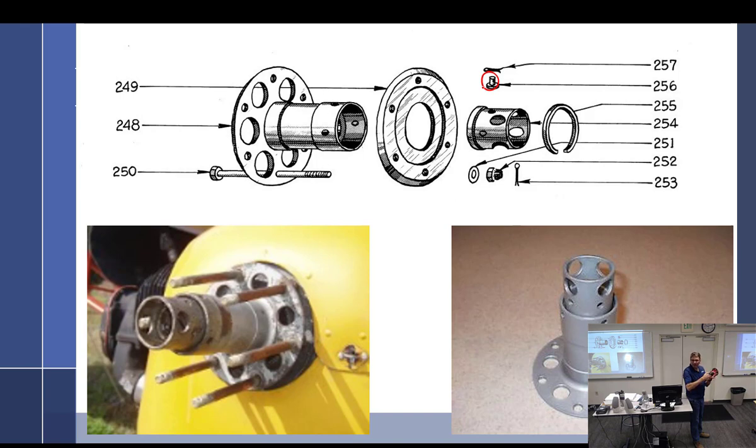All right. When you go to take it off, you loosen this up, and then it's going to get real loose. And you keep going, it's going to suddenly get really tight. What it is, there's a ring in there. See the ring right here? Mm-hmm. There's a ring. It's going to hit that ring. Now as you turn this, it's pulling this off of the taper shaft. So it's a puller and installer all in one. This you can turn to put it on. Don't forget, I talked about the Prussian blue inside. Talked about this before. So you've got to put a little bit of Prussian blue in there. Let's stick your finger in there.